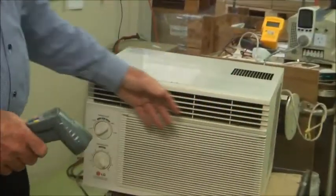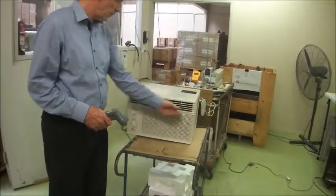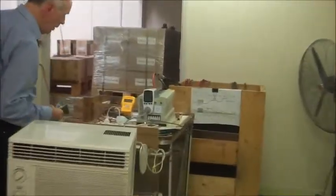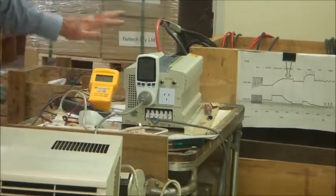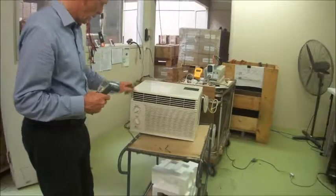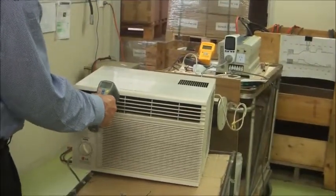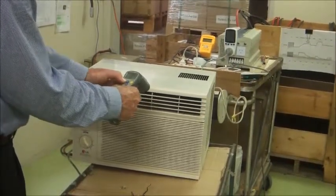So we've had it cooling for a little while and there's cool air coming out — I can feel it. The temperature over here is about 29 degrees. We've got about 560 watts going into the wall air conditioner. We've got the thermostat set to as cool as possible, and the temperature has dropped to about 20-21 degrees coming out of the air conditioner, so that's working quite well.